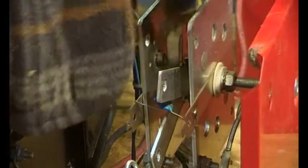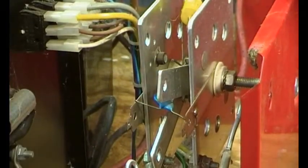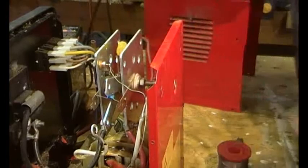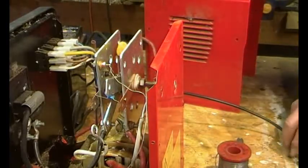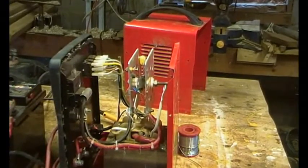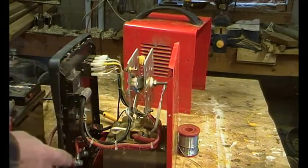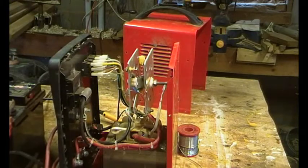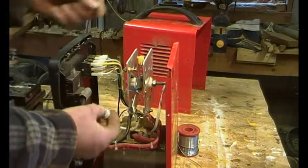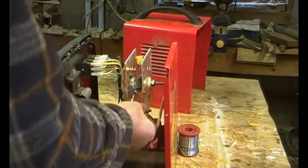Let's clip that wire and I'll solder the new diode in first. That looks like the diode is in place — it's fitted and the tail cut off. Now before we do anything else we need to reconnect the AC back to the rectifier.